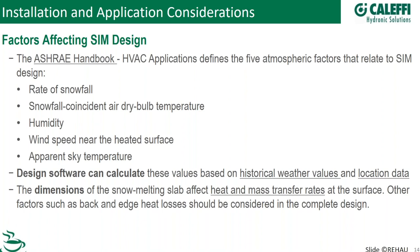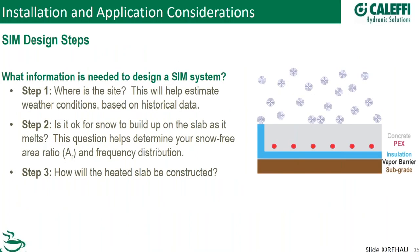The information from the ASHRAE Handbook helps you size your system — specifically, how many BTUs per square foot you're looking for. The 2019 chapter update advocates for more realistic recommendations. In the past, you might have found that you could do 400 BTUs per square foot in Baltimore — that's not necessarily practical. It's how much energy from a physics standpoint it would take to melt the snow, but it may not be achievable. The 2019 recommendations are more about avoiding oversizing.